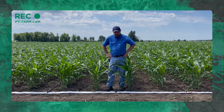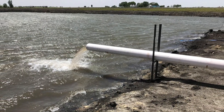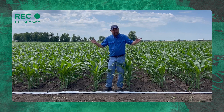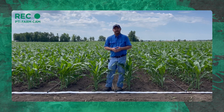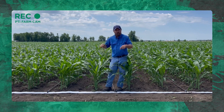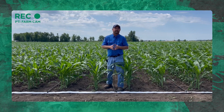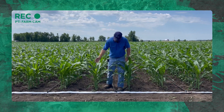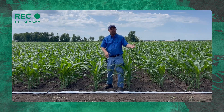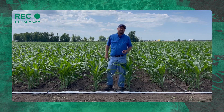I don't have a lot of water, and we don't irrigate 100% of the farm. I've got a reservoir that we built here at this farm. We had drainage issues, so we went to our prairie pothole — our lowest elevation area — and built a reservoir. Then we put farm tile in to drain our soils, to make them healthier so we can make timely operations. All that water feeds into mains that go right into the reservoir, and that's my water supply for this Netafim drip tape. This is one of the coolest projects I've ever worked on because we're recycling rainwater. The water we push through this FlexNet and drip tape is rainwater that fell, went through the soil profile, went through our tile, and ended up in the reservoir. When it turns hot and dry, we pump it back into the field. That's our means of irrigation.